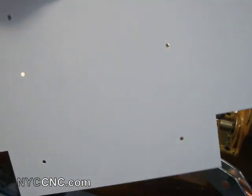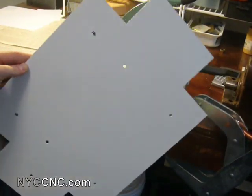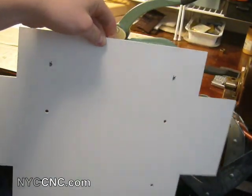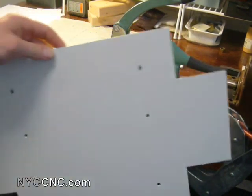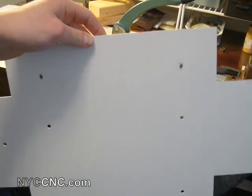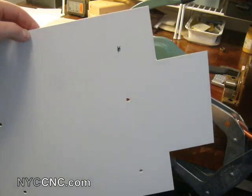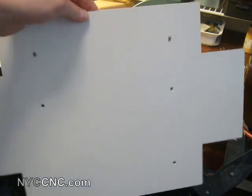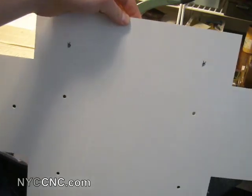So that's my sheet. The next step is actually going to be to paint it. After I paint them they have to set for about a week — I'm using just a home-based latex or acrylic paint, so letting that paint sit for a week helps it cure beyond just drying before I bend it into a box. So next episode you'll see the final box.